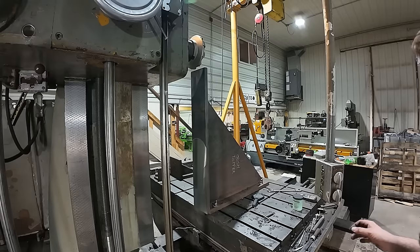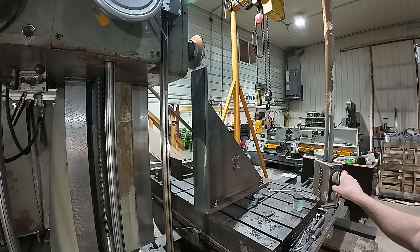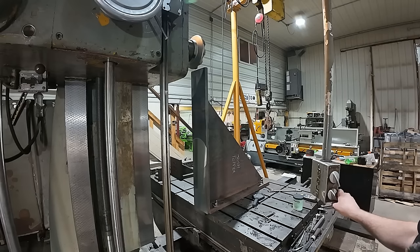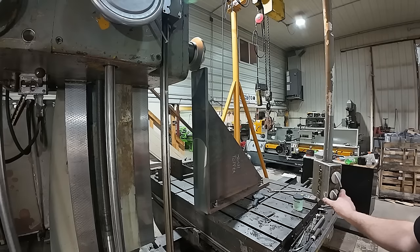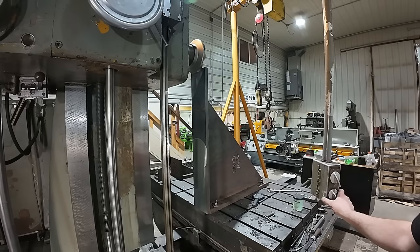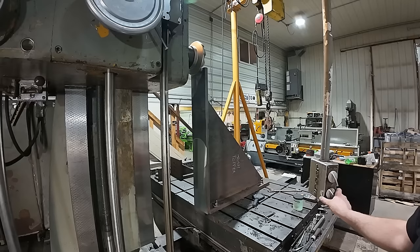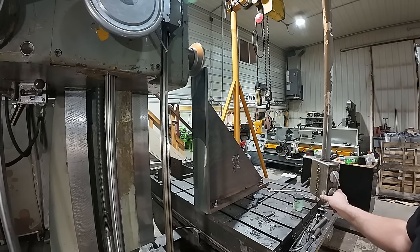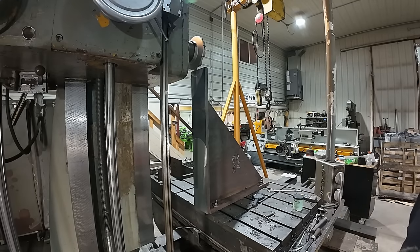Okay, so just out of curiosity, I tried increasing the spindle speed, just to see if we can get more inserts in it and between vibrations. It's worth a try. And I'm only taking 10 thousandths. That was worse, so let's slow it down.